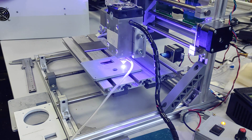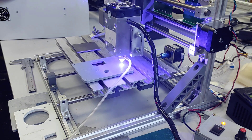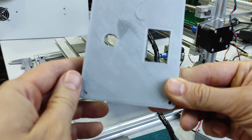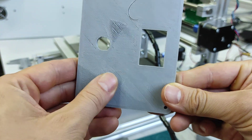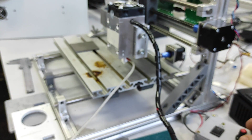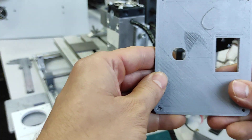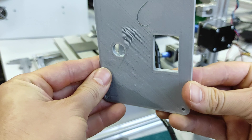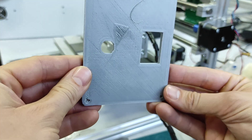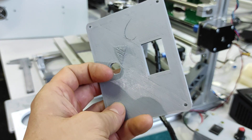Just to keep you updated — we're using our 10 watt deluxe laser here. This result is better, you can see. The power was set somewhere in the middle. So you don't need to adjust the G-code; you can just turn our dynamic PWM switch right or left to get the power you need.